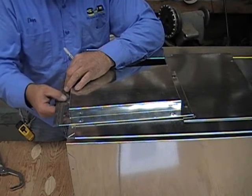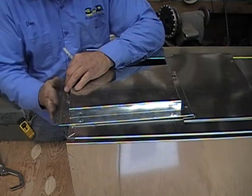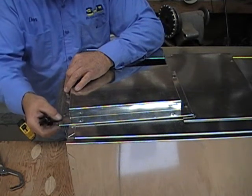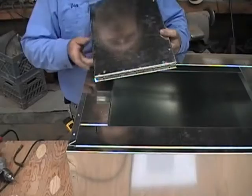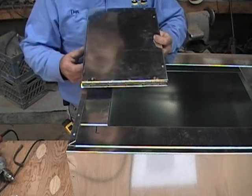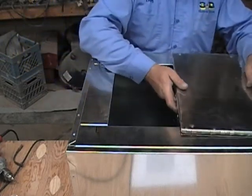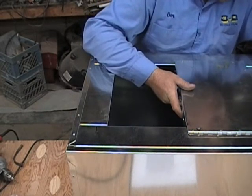To start off mounting the piano hinge, it's easier to mount it on the door first. Push it up to the door and pull it out about a sixteenth of an inch. That'll give it a little bit of distance so it's not going to bind up as you're opening and closing the door — it makes it more free to swivel. We've got four rivets in it. The rule of thumb is however many holes there are in the piano hinge, that's how many rivets you should put in. Then put the door back at the alignment marks and pop rivet it into place.